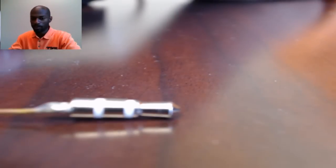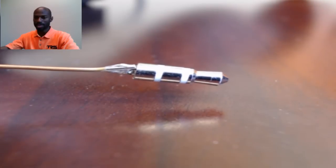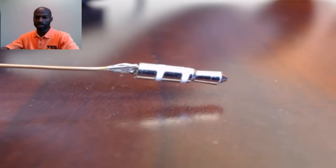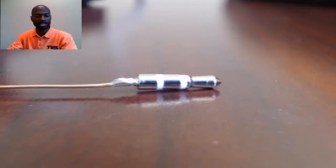I'm going to show you the actual piece we pulled out. If you look at it, you can see the little white rings in there. Depending on which headphone jack manufacturer made it, the rings could be white or black, but those are plastic rings. You have different rings of metal sandwiched with different rings of plastic, and when it breaks you're either going to have a piece of metal or a piece of plastic exposed. In order to get it out, you'll need a couple of things.